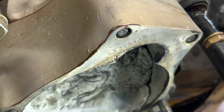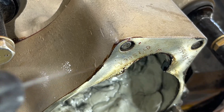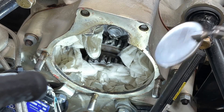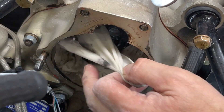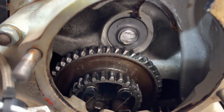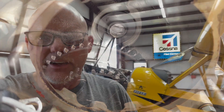What I'm going to do now is flush it out with some solvent — try to flush the clay out. All of this stuff, I want it to go down the back of the engine. I'll go around the other side and do the same thing. The particulate is on the magnetos — it gets everywhere. Even though we vacuumed it out, it still got everywhere. I vacuumed it out, flushed it out with naphtha after I pulled the clay and the rags out, then poured oil over the gears.